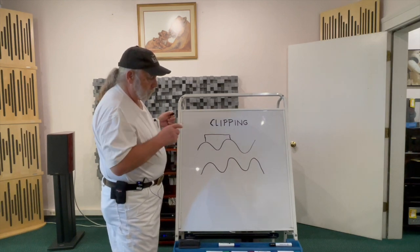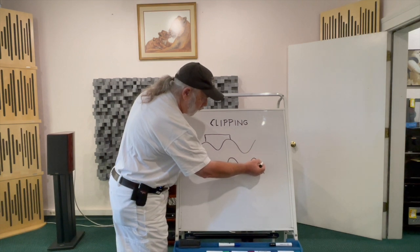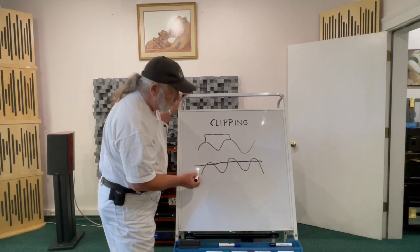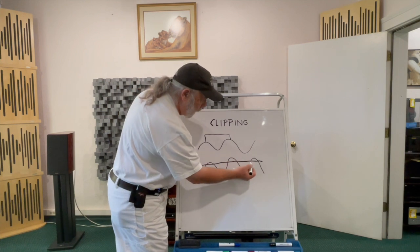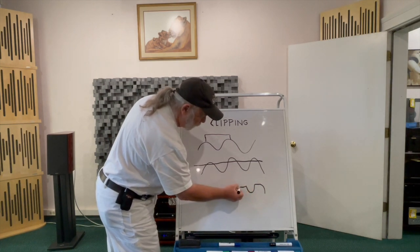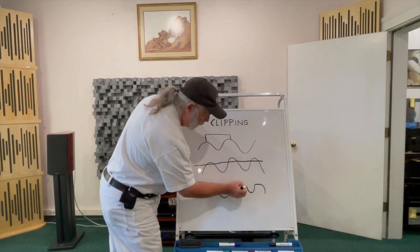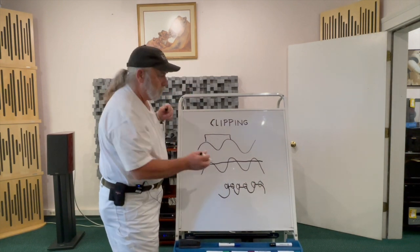And at that moment, the response is essentially like taking a knife right through the form. And what you get is a shape that starts and then goes flat, goes down, comes back up, goes flat — goes down flat. So you have essentially clipped the sine wave.